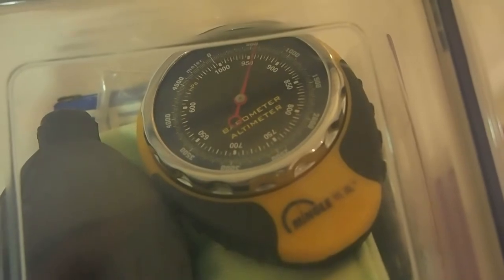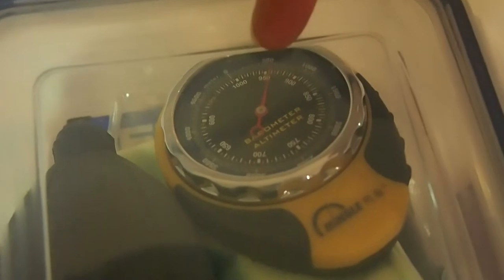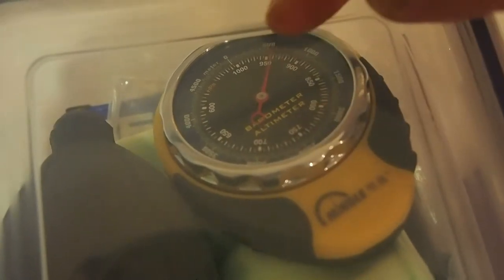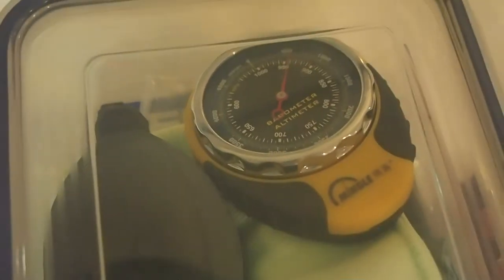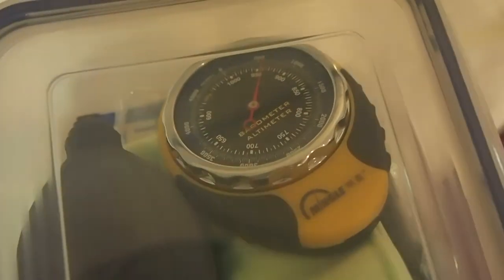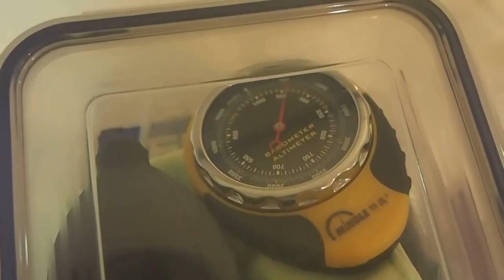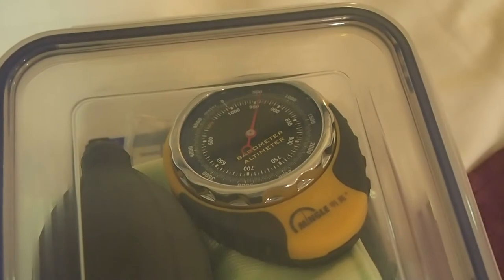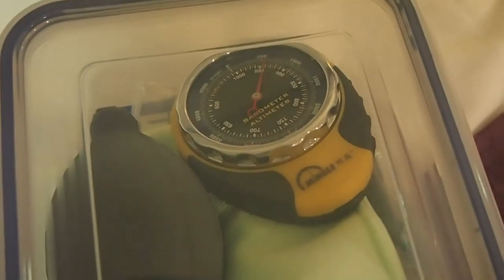I did calibrate the barometer before takeoff. Looking at the outer scale in white — that's 500, that's 1000, and that's 1500 — it looks like we are at 600 meters of equivalent altitude. I'm here on the ground at zero meters. Now I'm going to watch the barometer move back to zero as I open the box and loosen the lid to allow air back in. Let me focus the camera on the meter so it's clearer.